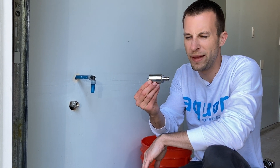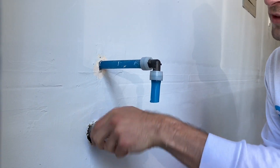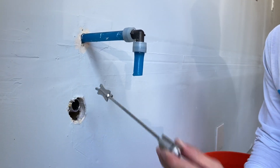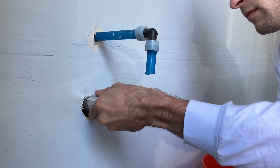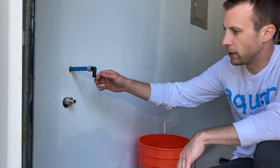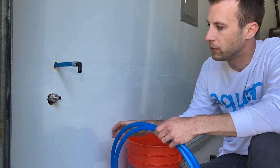Now with the hydrant attached to the wall, it's time to connect to the plumbing. An optional accessory we'll be using is our PEX expansion inlet, which lets us skip using a threaded fitting and adapting to the PEX and just go straight to it. Less threaded fittings means less chance of leaks — always a good thing. The standard half-inch NPT hydrant inlet is on the main hydrant body, and we'll attach the PEX inlet — just hand tight. With some of the existing PEX cut away, it's going to be an elbow coupling going from the PEX line to the new fitting.